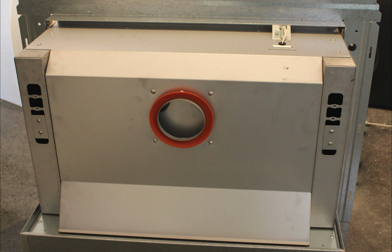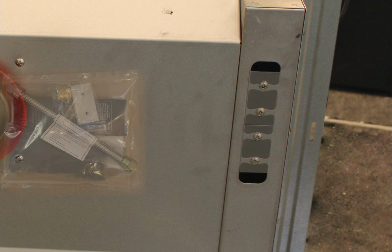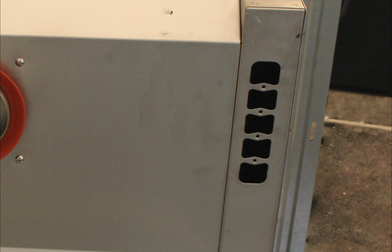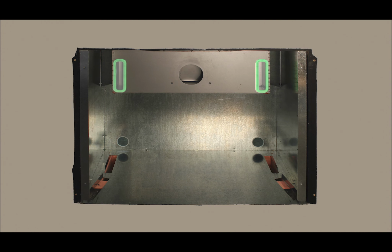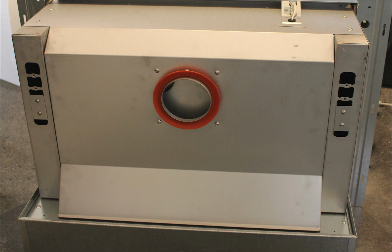The fire is set up for a total flue length of between 3 and 5.5 metres. If the flue is longer than this or is using a common power flue, then you'll need to add the supplied shutter plates to the back of the fire, or remove the plates for flues under 3 metres. Make sure that the green air seals are sitting in place on the flue adapter box and that the red flue seal is sitting on the spigot on the back of the engine.